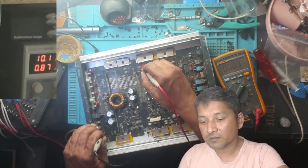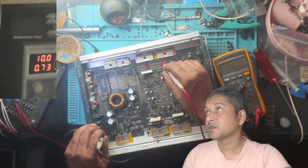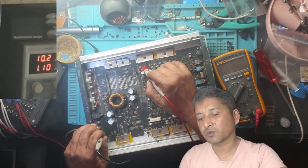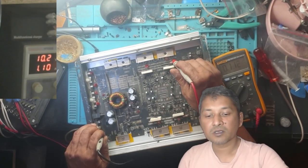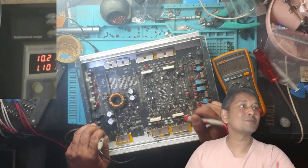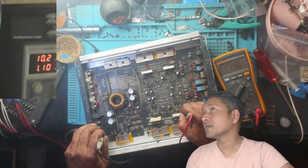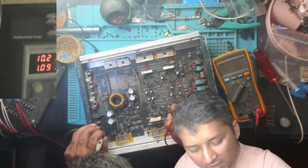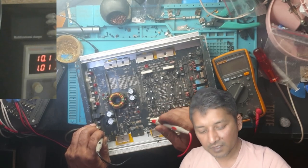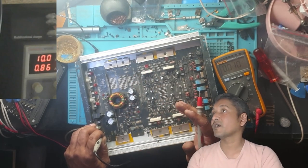10 volt, but let's see on the 15, 17, otherwise this one is minus 17, good. Okay, minus 17, plus 17, minus 17. Sorry man, I'm just busy with the video. No worries. Okay. We have this one 17, plus 17 is present, minus 17 is there, minus 17 is there, this channel plus 17 is there. So means all these channels we have our output.